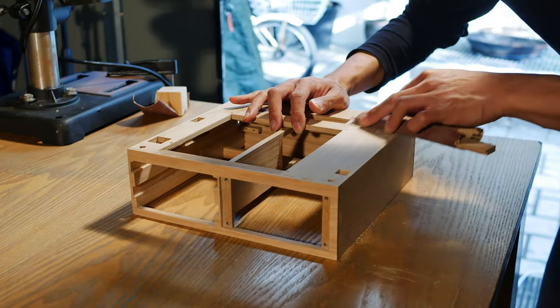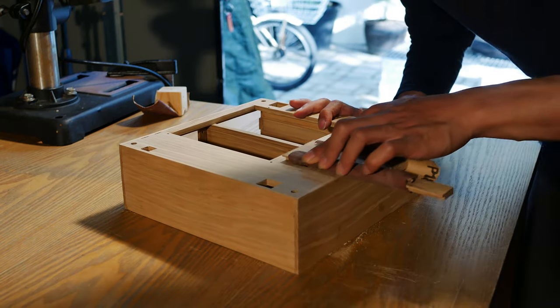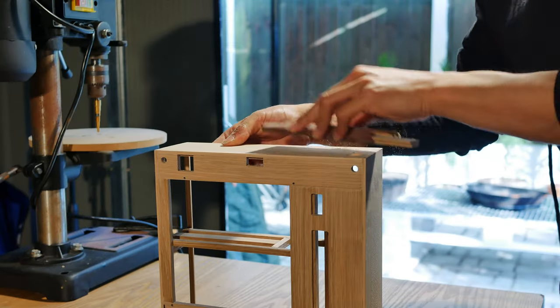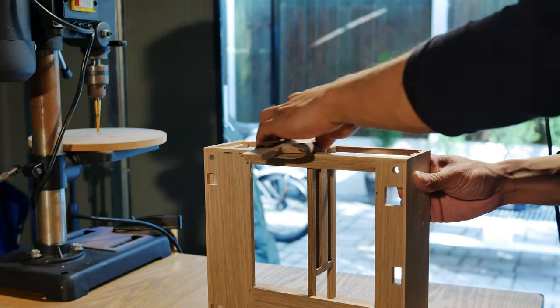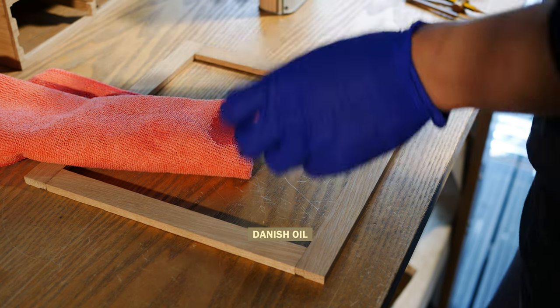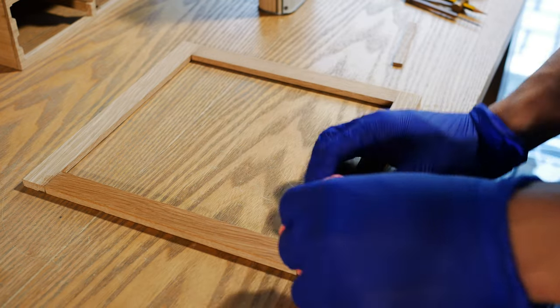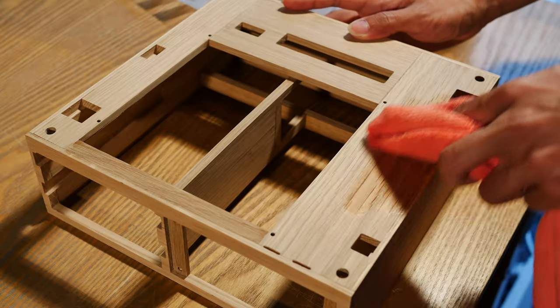Anyways, as much as I've grown fond of the pale, dainty appearance of raw white oak, it's best to treat its surface. All wooden parts are prepped by going over all sides with sandpaper and edges with a rasp and smooth file. Our chosen treatment is Danish oil, a mixture of oil to bring out the wood's appearance and varnish to provide better protection than oil alone. Plus, it's awfully easy to apply. I think so anyways.